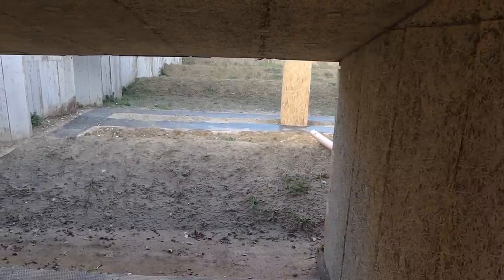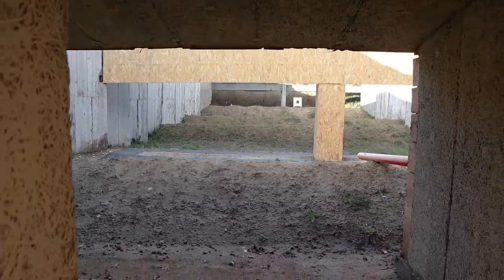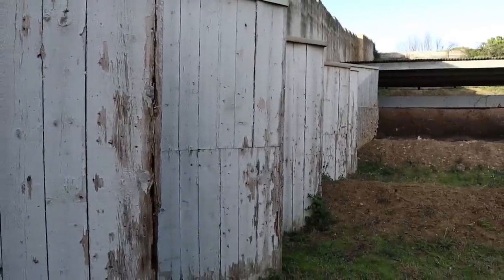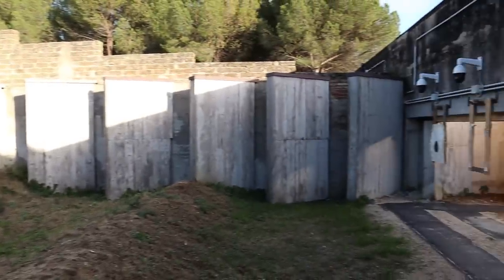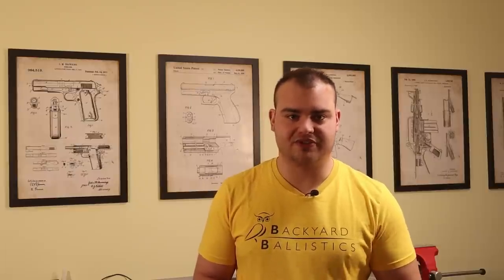Even wood and soil have a critical ricochet angle of about 30 degrees, much larger than that of water, so in order to avoid bullets skipping out of the range, we need to make sure that from any shooting point no surface rests at less than 35 degrees. Both the walls and the ground of the range, if left flat, would violate this condition. For the walls, we place additional baffles — simple brick walls clad in wood — angled so that an incoming bullet will hit them at an angle larger than 35 degrees. On the ground we do exactly the same, but it's even easier since we just have to pile up these mounds. On some small surfaces ricochets can still happen, so for those regions we make sure that any possible ricochet will hit another surface inside the range; if not, the geometry needs to be modified.